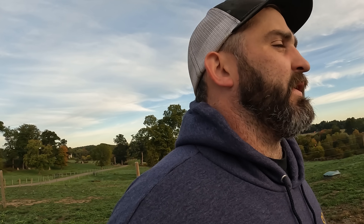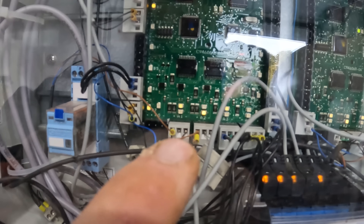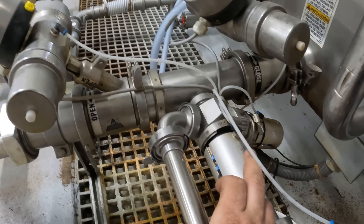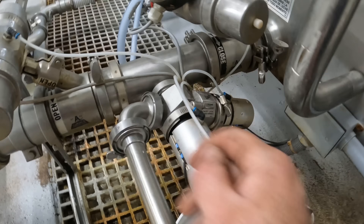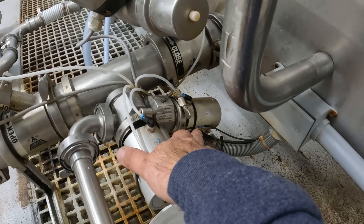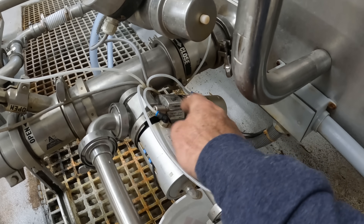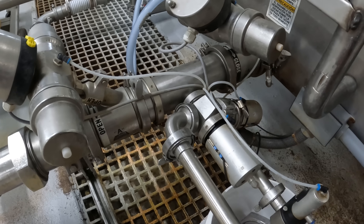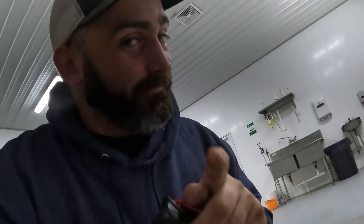I've got another stop this morning — nothing too crazy, probably pretty quick in and out. Figured I'd show you a little of what I do for a day job, fixing stuff like that. As we can see, A2 is now lit up — it's happy. We'll come over here: this is the milk valve from the master robot, which allows milk into the tank. The clean valve light is on, which means it is shut because the air is not on it. There's air on the milk valve, allowing milk to come down and actually go in. We've got it — good to go.